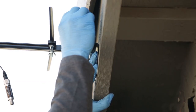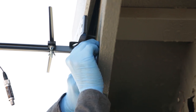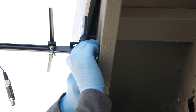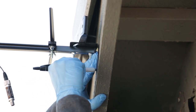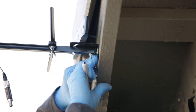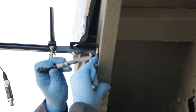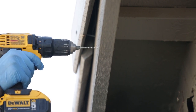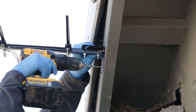When installing the Stealth Antenna to an eave, place the attached angle bracket up against the side of the eave in the spot where you want the antenna mounted. Make sure the antenna is completely straight — you can do this by placing a level on the top side of the antenna while holding it flush against the eave. Next, use a Sharpie to mark the location of where the holes need to be drilled. Then drill four pilot holes into the eave using a 1/8-inch drill bit, and use lag screws and a power drill to attach the Stealth Antenna to the eave.